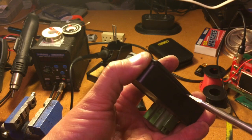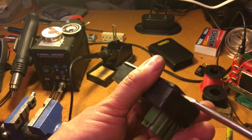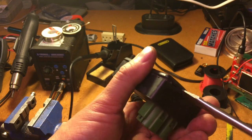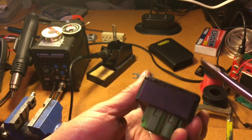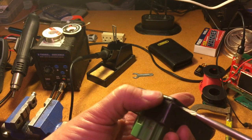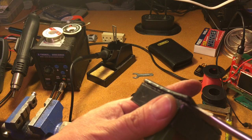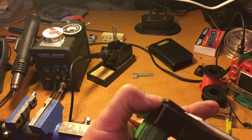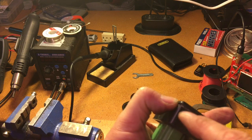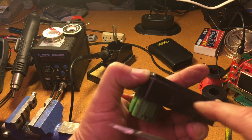You want to be careful here not to do anything to the back of the board. I have a plastic spudger that I'll use to pry this up a little bit. After you make a cut and it's about a couple of millimeters deep, you can kind of see it right there — that's the backside of the board.